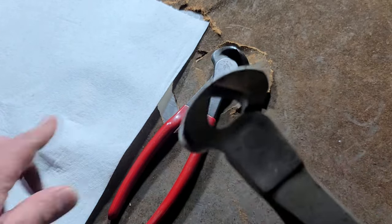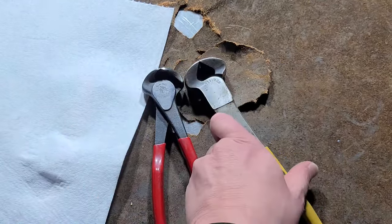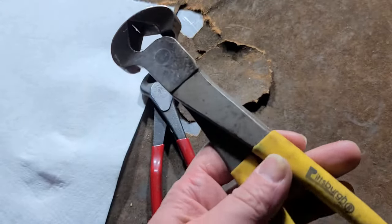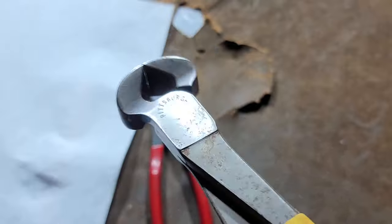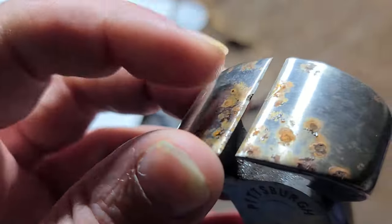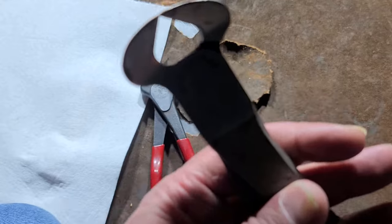There's actually a variety of uses. Looking at some reviews — I think I had the Doyles but they're buried somewhere. The Doyles are going to be a lot heavier duty with a much heavier duty rivet. This is a hot rivet, and it actually is surprisingly tight, although this pair is nearly new. One little small notch in the jaw. So if you cut things like deck screws or piano wire, it is going to ding up these jaws.